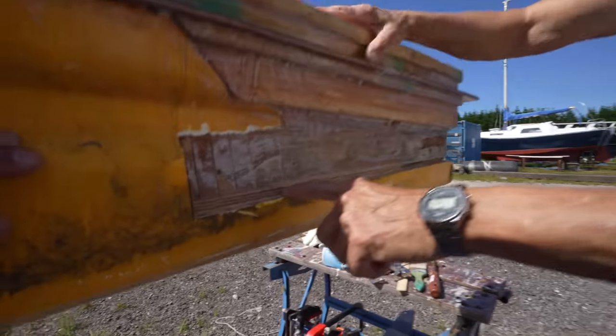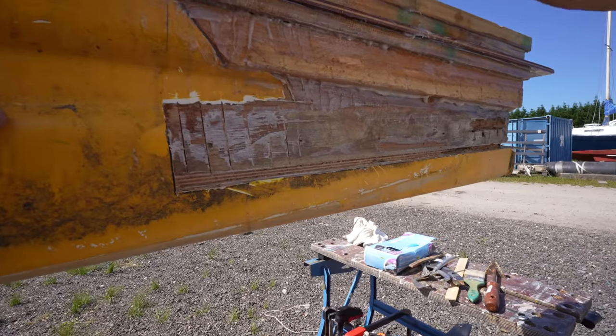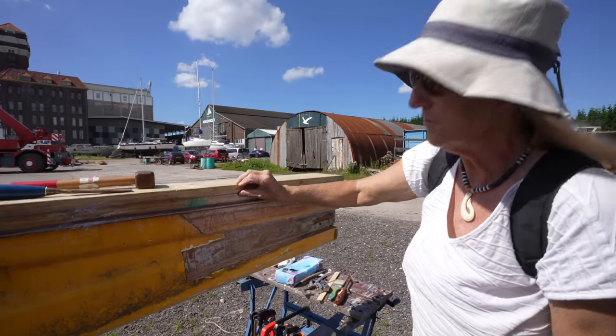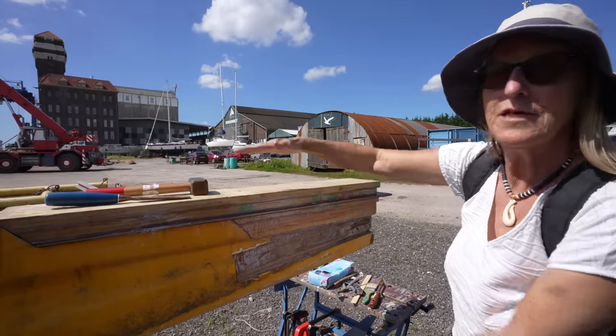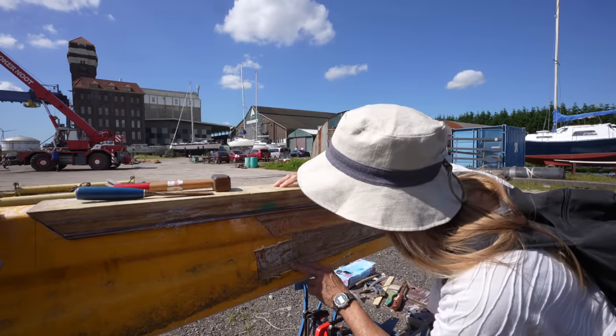Well, you've done the same here. Maybe he was just trying to get... I can see what he's done. He wanted to get the right depths, and these wood laminations were a bit thinner than on the drawing. Okay. So he thought, I'll put it there, and then we have to put solid wood on the outside where it counts. It's alright, it looks like good plywood.